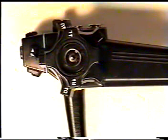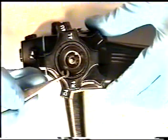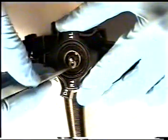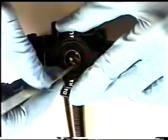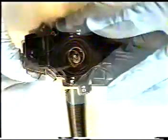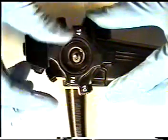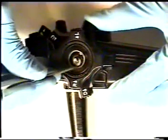Now, from the parts that you have reverse sequenced, we have now reapplied the up-down knob and the left-right knob. We will now replace the C-clip to the shaft over the left-right knob using a pair of tweezers. Fit the C-clip in the slot above the base of the left-right knob. Slide the clip onto the shaft. If this C-clip did not fit, it meant that the left-right knob was not seated down properly into the chain drive assembly inside the body section.